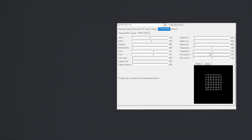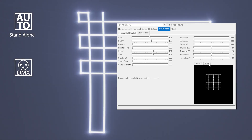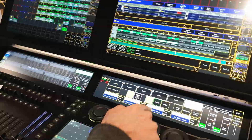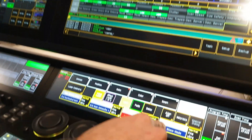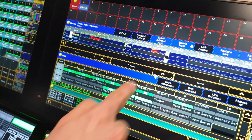The laser can be safely operated in stand-alone operation and even in DMX and ArtNet mode. A great advantage of the ShowNet laser mainboard is that all output-related settings can be made with the admin tool software or directly via DMX or ArtNet. Settings can be written back and stored in the mainboard using DMX and ArtNet alone, which makes a computer superfluous on the production site.